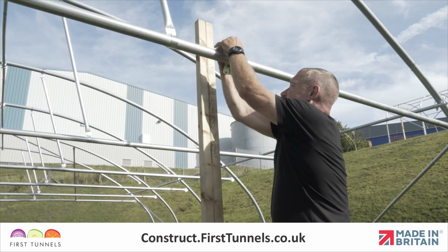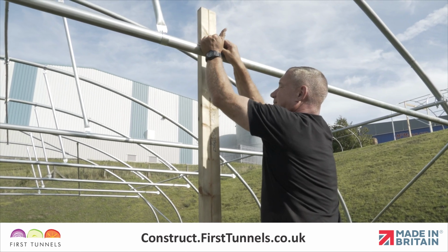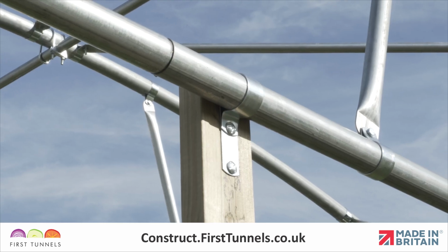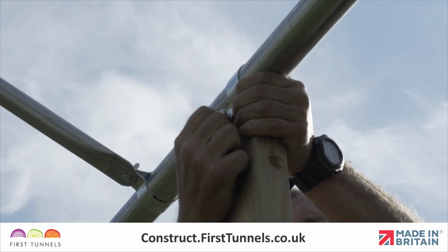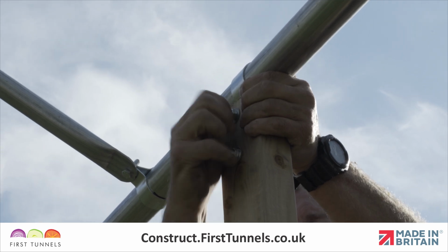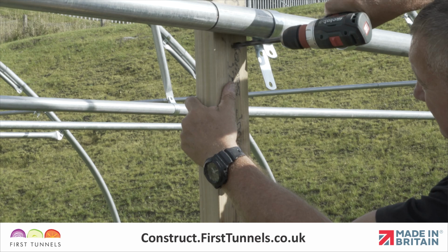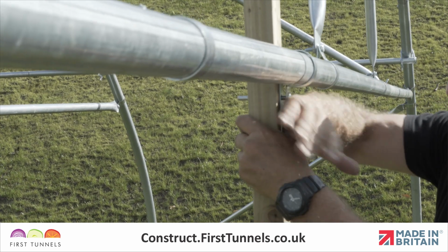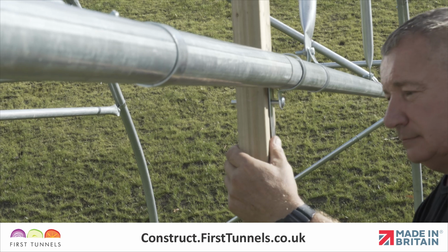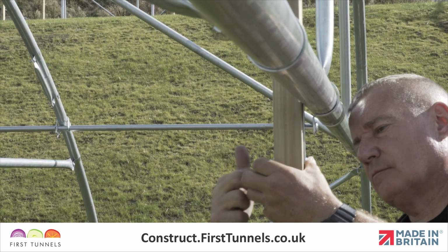To secure the top of the door frame post to the door rail, fit a P-clip onto the door rail. The prongs of the P-clip should run down the rear of the door rail and fix the front face of the door frame post where it is held in place with bolts. Using a 9mm wood drill bit, drill through the timber on the marks. Push a bolt through the P-clip and drill holes so that the thread is on the inside of the polytunnel. Loosely secure in place with a washer and nut.